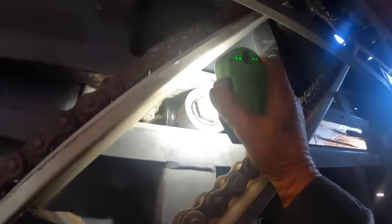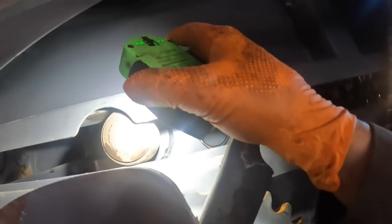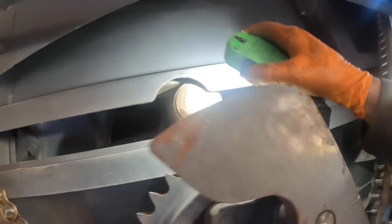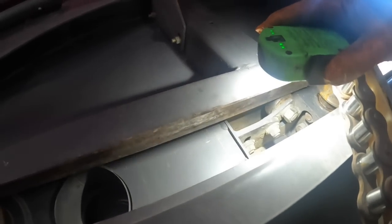This one here, I noticed, see the front bearing here? See the grease cap on it? And another thing you kind of noticed too, when I looked at this and I seen the grease cap, see how it's been rubbing on here? That shouldn't do that. That's an indication that the side clearance on the plunger for the bearings isn't set up right. And see how the arm's bent up? That's not really right either.